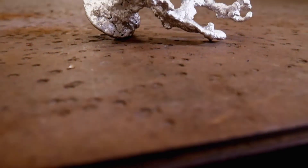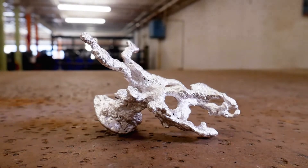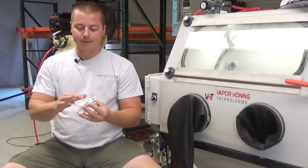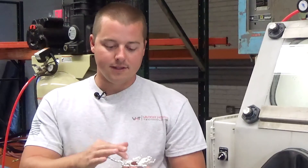The purpose of the video is to show you how we can clean aluminum. You could see where it was oxidized — it had just come out of the ground, so it had a lot of impurities and contaminants on the surface, but we cleaned this product up. This is a very porous cast because it was in the ground, so it really shows you the capabilities of the cleaning process of vapor honing.